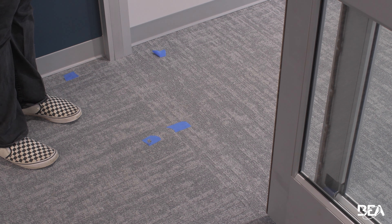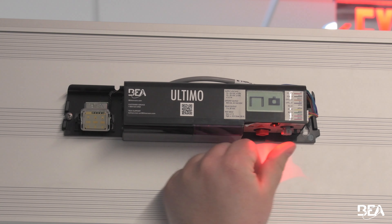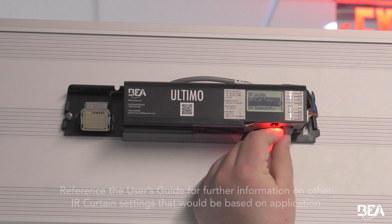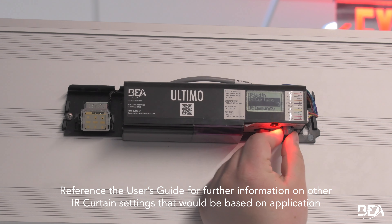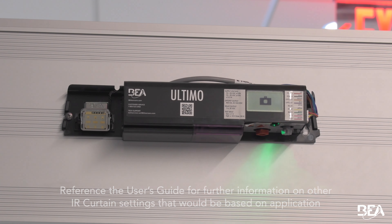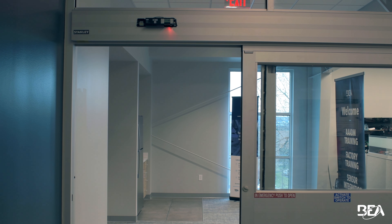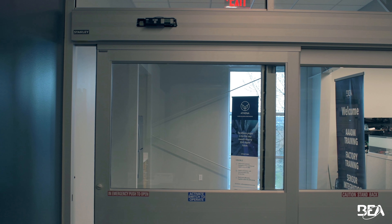When adjusting our curtains for non-threshold detection, we want to make sure that our first curtain is now within three inches of the face of the door, the width of the door opening — much like the second curtain for threshold detection. Now that we have our curtains aligned, click in on the gray knob twice to turn the spots off, click in one more time, scroll down to IR curtains, click in, and this time set the curtains value to three. Click in to confirm, turn the knob to scroll to Back, and it will go through a setup.